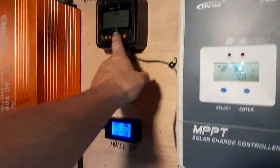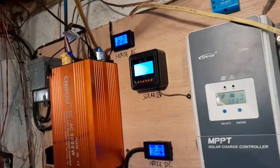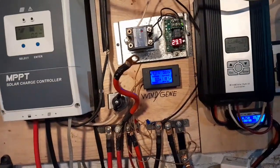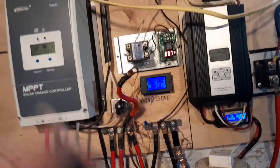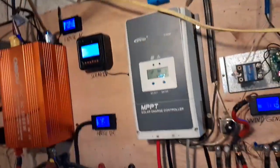That's why my panels are cut down. I should be making close to 1,400–1,500 watts at this time of day and it's only making about 650. The wind's not blowing strong but it is moving, so the brakes are on and she's just locked up. If I had power venting to the hot water tank, that would pull 600 watts out of the incoming power, and the solar panels would keep pounding power into the system instead of being choked down, and the brakes would be off the turbines.